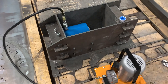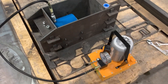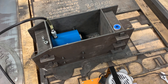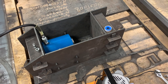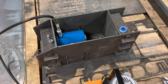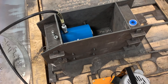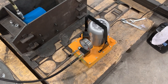That's our setup — it'll work great for what we need it for. It might not be fantastic for a universal press, but it hopefully gives guys some good ideas on some of the less expensive equipment. To actually get a hundred tons with a hydraulic cylinder at regular hydraulic pressures around 3,000 or 3,500, you'd have to go up to like a 10-inch cylinder, or go smaller like a six or eight, or maybe even a four and leverage it to multiply that force. For what we wanted, we wanted a single cylinder — this is about a six-inch cylinder, seven inches on the outside — single cylinder, small frame, compact, without having to use arms or levers to multiply the force. This little portable power unit will work out great for us.